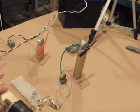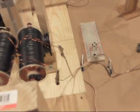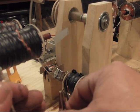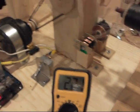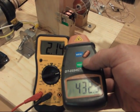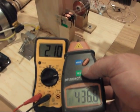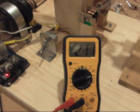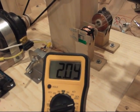So here we go — we'll try it and show you how it works. I want you to see how sensitive this wheel is with these two coils. Let me just turn it by hand. You can see just by turning it a little bit, the motors take off. If you hook them to that little coil down there, they don't even want to move by hand. We'll take everything off of it — there won't be anything on it. We'll turn it on to the amps and the coils and the RPM, let it spin. We're reading 435 RPM and approximately 2.1 amps.